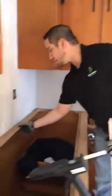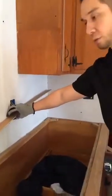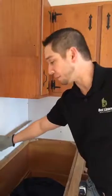If you'll look over here, you'll see how the cabinets are touching the wall at this instance and then bumped off the wall about 5/16 before they get to that corner. Yeah, so you can really see that gap right there. So if the granite was to come out in a straight edge, it would not touch that wall all the way down through there, which would be very important, especially if you were doing a tile backsplash that needed to come down and hit the countertop.